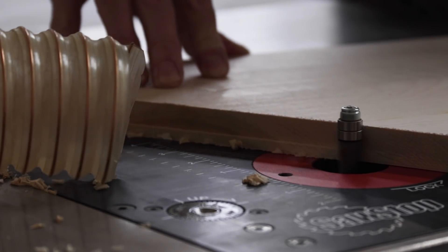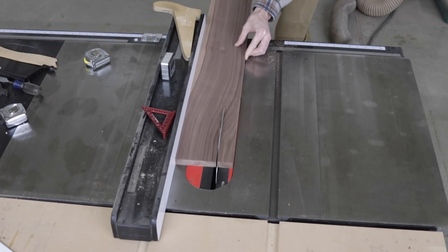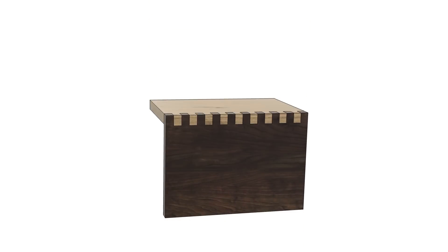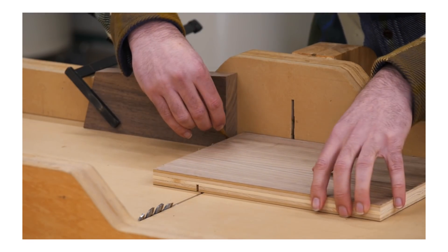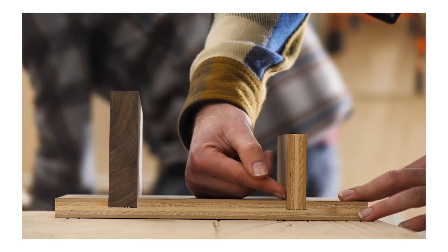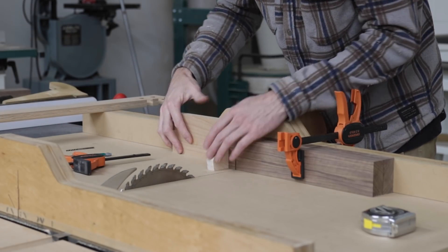Now that I had all of the maple panels to size, I could cut some long walnut strips that would become the slats of the bench. These were obviously simple to make — just a few rip cuts on the table saw, and those were done. Then I could start working on the cross pieces. These took a little bit of setup to get just right, and I'm essentially making one side of a box joint for these. I've made box joint jigs in the past and they work well, but for this application I decided to use a version of the drill bit dado method. We put out a video a few weeks ago with a few different woodworking tips and tricks, and one of them is this drill bit technique. I'll link to that video in the description if you haven't seen it — this technique is something I've been using for a long time, and it always works really well.